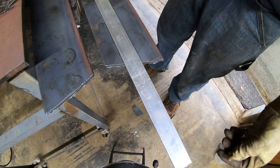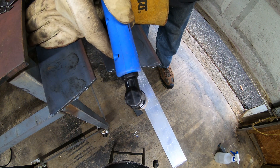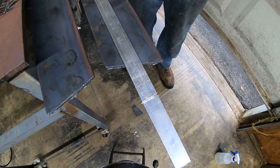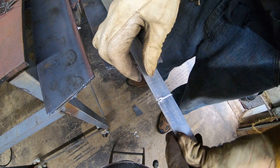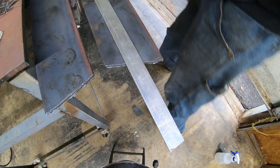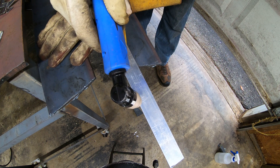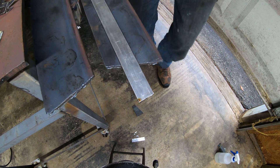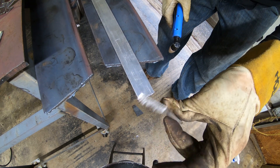I'm just going to cut out a couple of four-inch test strips. I set it to 18 amps. That's not enough for a complete cut. So 18 amps is too low for eighth-inch aluminum — taking it back up to 30. This is one-eighth aluminum. There's the 18-amp cut and there's the 30-amp cut.